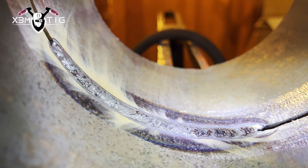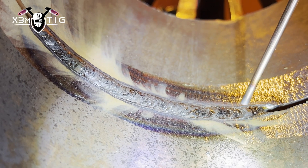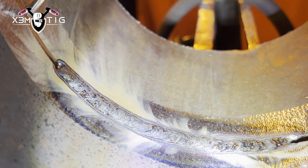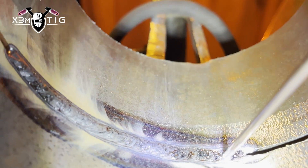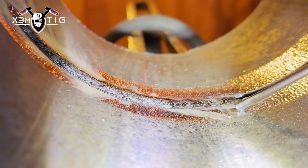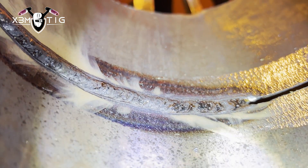This part is done. As you can see, the bottom at six o'clock — pay close attention to that six o'clock, this is the most crucial part — and that's good enough. It's a little bit above the surface, which is really good. As you go up you have a nice good build-up. I'm just going to continue on the other side of the pipe.